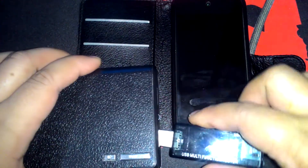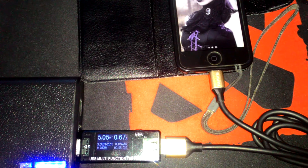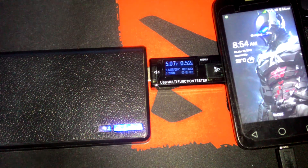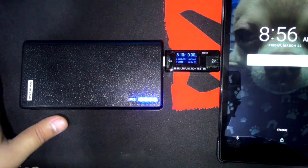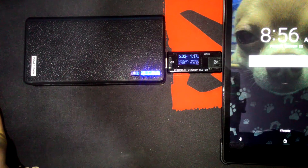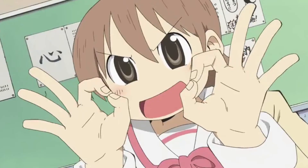So as you can see here, it finally finished charging — currently on full capacity as shown by the battery level indicator. Now I'm going to use this one again for testing. It's charging at around 5 volts, 0.5 amps. Now let's try this phone — same charging rate. And then let's try this tablet: 5 volts at 1.4 amps, and on this port just about 1 amp. So we now know that our DIY power bank transplant is successful! Thanks for watching and see you again next week.